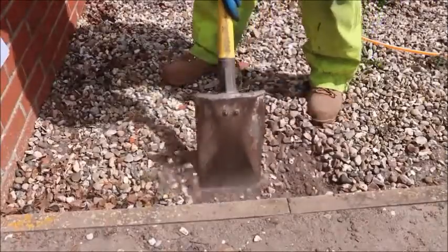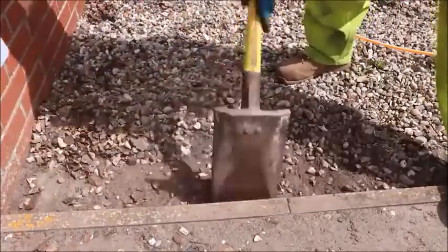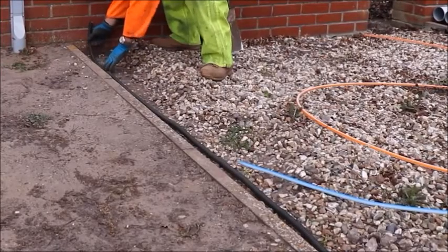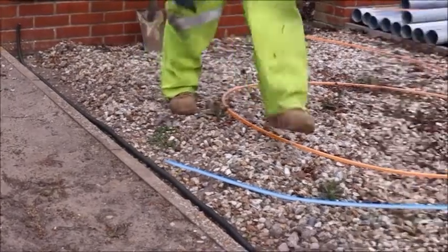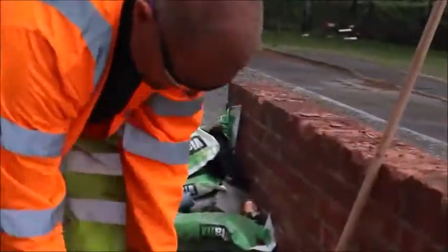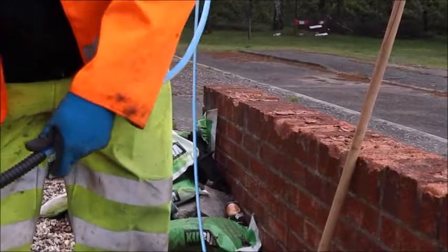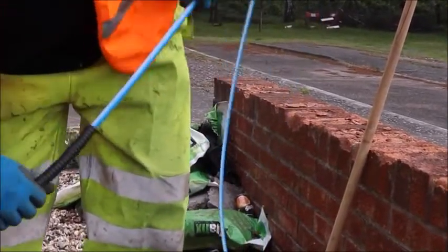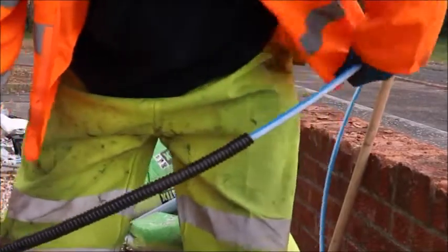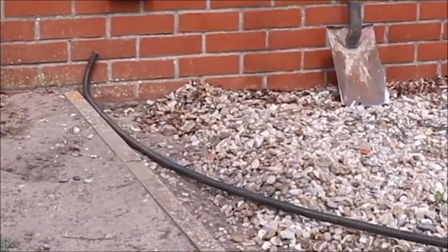This tubing is to be buried in a garden that contains gravel, so firstly scrape the gravel away and use the black flexible conduit available through Gabacom or through the EASC stores to house the tubing. Once in position, you can then feed the Gabacom tube into the flexible conduit duct to be buried.